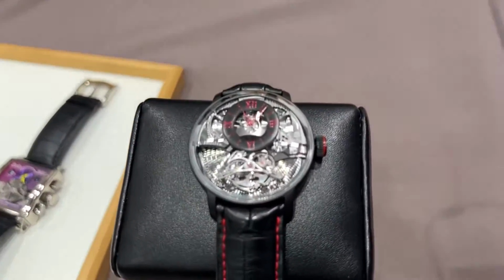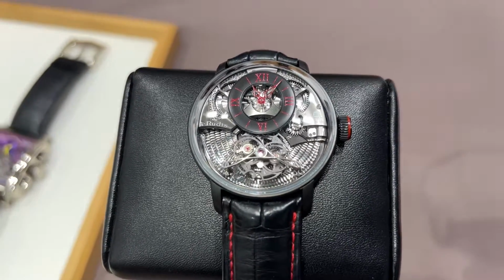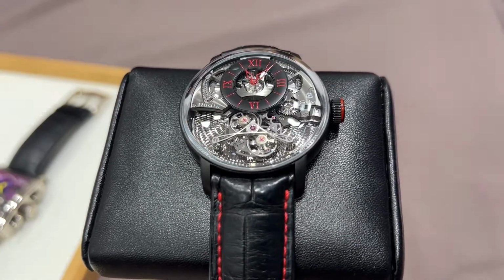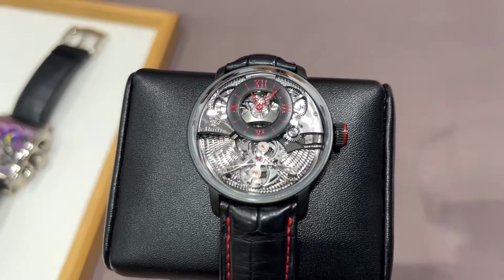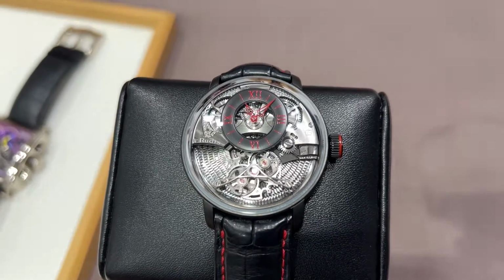Okay, so now we're going to look at the watches. But first question, Jackie, tell us, how did this whole mechanism come about? In the beginning, we started to analyze and think about a resonance piece. We made some mistakes when we built up the movement, and our watchmaker had an idea to put teeth on the balances and to connect them together. So we made some progress in teething these balances and saving some energy. And by the end, we discovered that this system, particularly with an inverse hairspring, has given us super precision, and also cancelled the effect of gravity immediately.